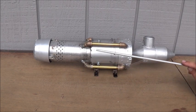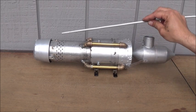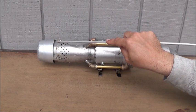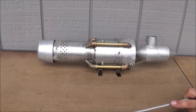Air passing in the outer case will be directed through this line of holes right here at the end of the engine. We have an afterburner and then we have a tertiary opening here that will gather extra air from outside of the engine and throw that through the last final reducing collar there.